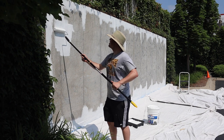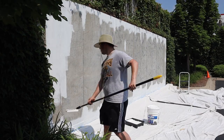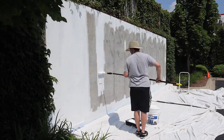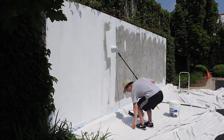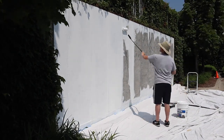To start this project off, we need a really good base for our paint to stick to. So we filled all of the pit holes, all of the cracks, and now we are priming the entire wall. I'm doing circular motions and really pushing on the wall because it is a pitted concrete surface, so I'm really trying to fill all of those little pit holes with the primer.